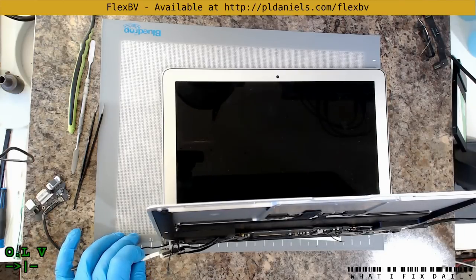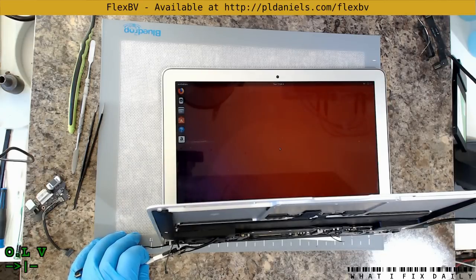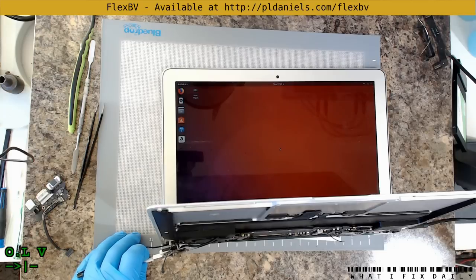Looking good. So we've got a fix. In the end it was just that connector — the J9500, the 3V42. Some sort of liquid corrosion got in there. It was interesting that it was just located inside that connector. It's always amazing how liquids can end up in places. I'll replace the DC in-board just as a precaution, obviously along with the cable. But it looks like we've got a win. Thanks for watching — I'll see you guys next time. Bye.